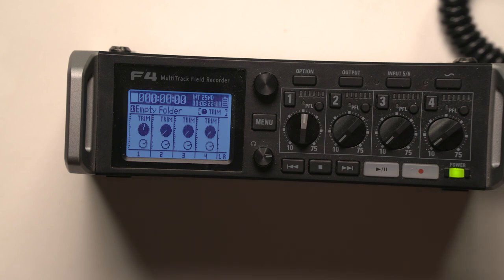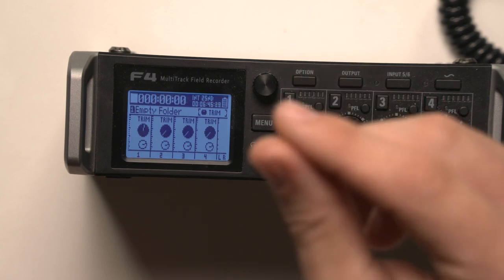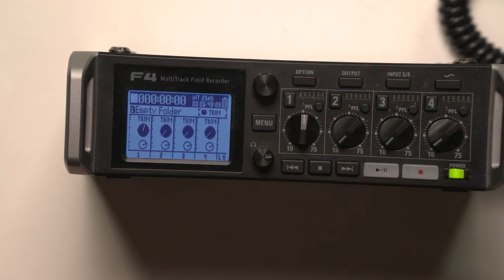So it's really important when you're recording a microphone that the incoming audio level hits in that Goldilocks zone of between around minus 24 dB to minus 12 dB. That is the sweet spot where you want the dialogue to be. So it's really important that you do a sound check, ideally before rehearsal, so that you can anticipate, you can preempt the sort of input level that you need to set the device at for that individual speaker and that individual microphone corresponding to that speaker on set.